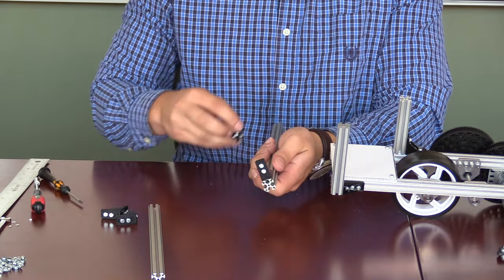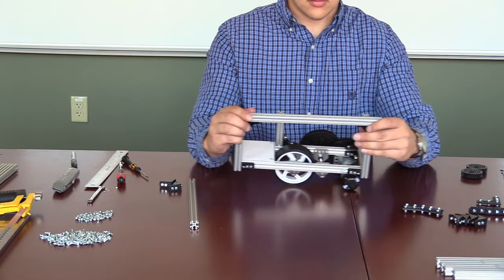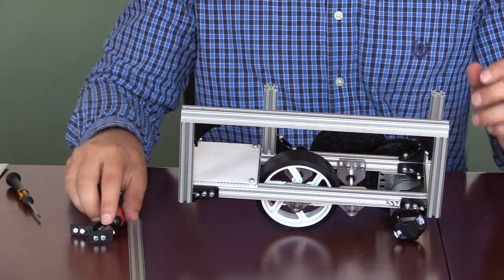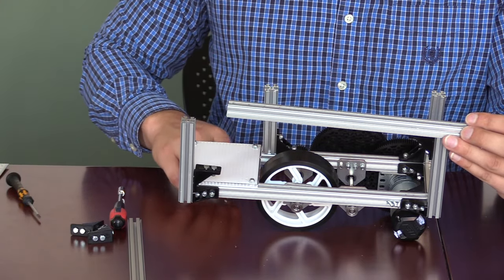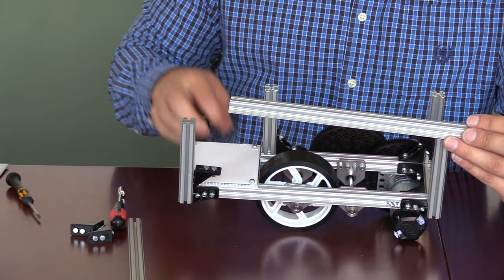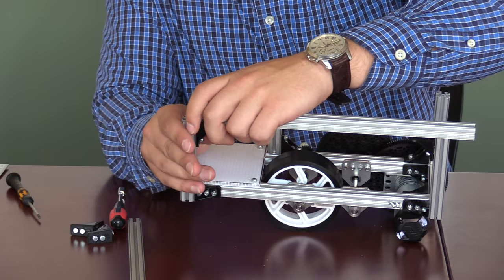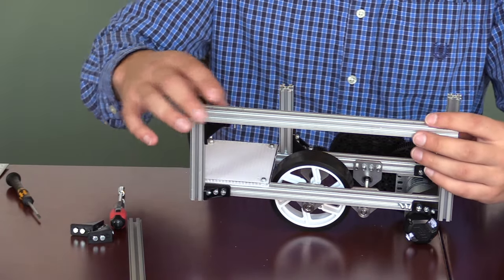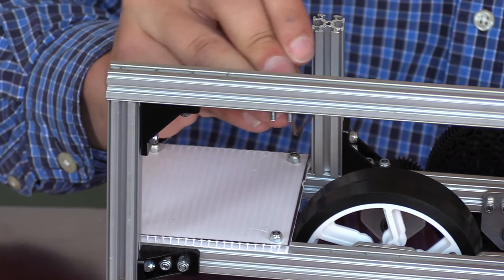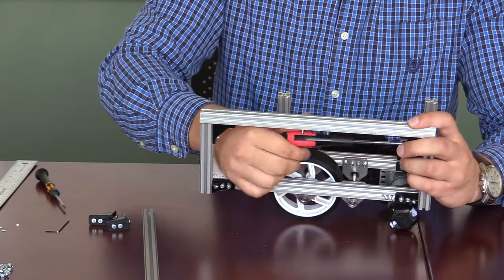For the next piece, we will need two of the 27.7 cm long pieces and four of the inside corner brackets. This will form the top of our shooter. At this point, we can indicate the extra screws you will want to attach to avoid problems later. In addition to the two screws sliding into the top part of the channel, we will need to slide in two screws to each of the four upright pillars — placed on the inside channel. Once you've added these additional screws, you can then tighten down the top part of the assembly.